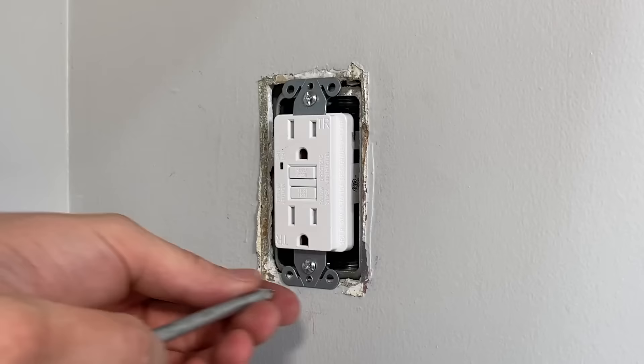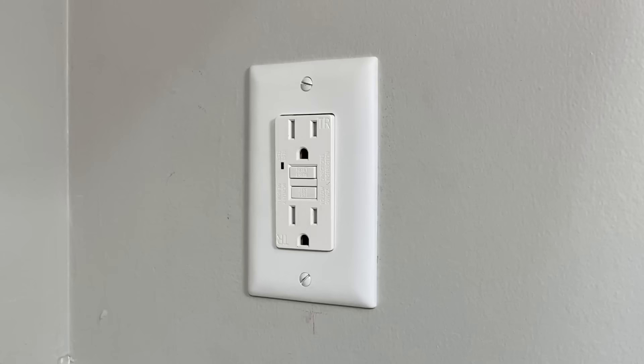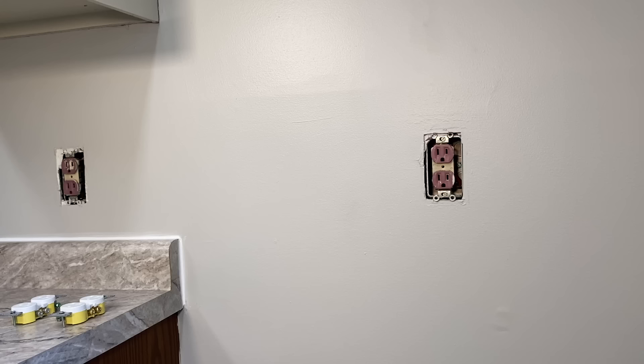Looks good. Cinch down the outlet, tighten down the cover plate, then hit the circuit breaker and reset. We do the test and we see there's power. Before finishing up and before I change out these other outlets, I just want to confirm they have power and the wiring is correct to the GFCI — which it is, and we're good to go. My wiring situation might be a little different than yours. If you have any questions, jump down in the comments and I'll help you out. In the description you'll find the voltage tester and the other tools we used. Don't forget to subscribe — we have weekly videos like this to help you with repairs around the house. Take care.